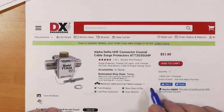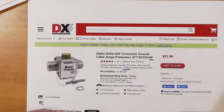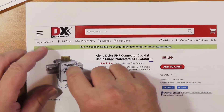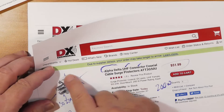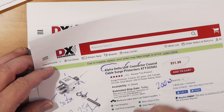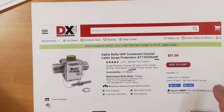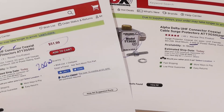This is the one on the recommended station list, which is fine because the ICOM 7300 — the reference rig — is only a 100-watt rig. So this is the perfect lightning arrestor for it. There is a high-power version with the same part number from the front, but it says 'high power' and it's 2,000 watts. On all antennas where I use my amplifier, I put those. You can also take out the 200-watt gas tube and put in a 2,000-watt gas tube. You can get the gas tubes separately at DX Engineering.